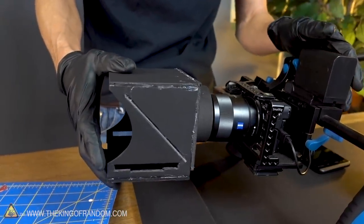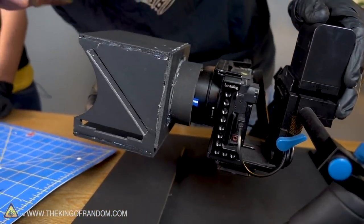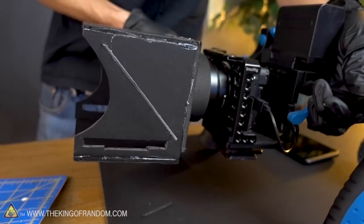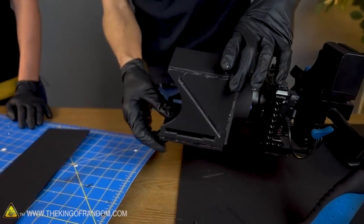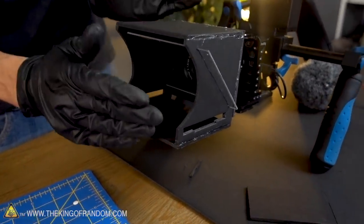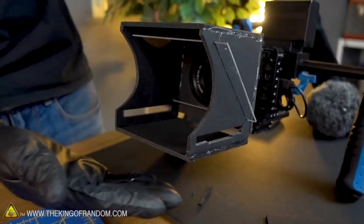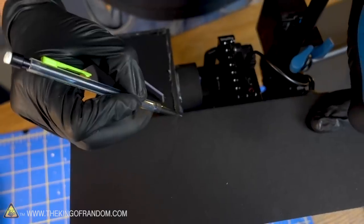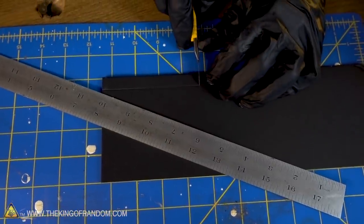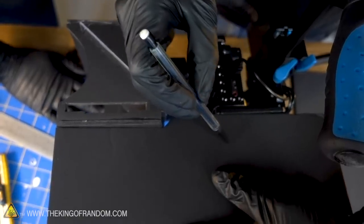The teleprompter box is mostly built. There's one more thing that we might want to do — you can see how nicely it fits right over that lens. The last thing we want to add is a little bit of support, because the box itself is actually quite lightweight, but once I add the phone it's going to get a little bit heavier and it can start to droop. You're also putting more weight on the end of the camera, which is going to make your hands tired if you're holding it. So we just want to add a little bit of support — a piece that extends off the bottom and rests up against the base of the camera. If it does try and tip, its leverage is pushing up against the bottom of the camera base, which should center the weight so it's all much easier.